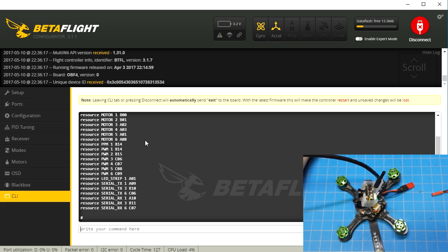So all we need to do is map motor 2 to motor 1 and motor 1 to motor 2. I use a notepad and I do encourage you to either write it down or copy this information into Wordpad or Word and save it in digital format. So I'm going to write down: motor 1 needs to be B01, and motor 2 needs to be B00.